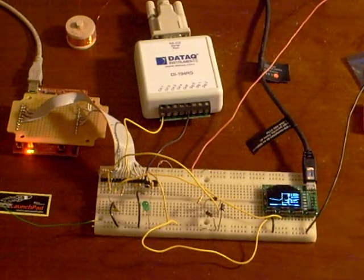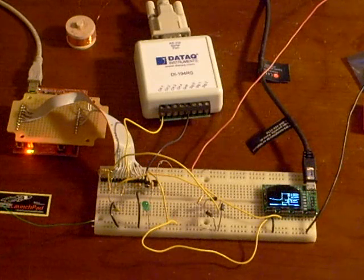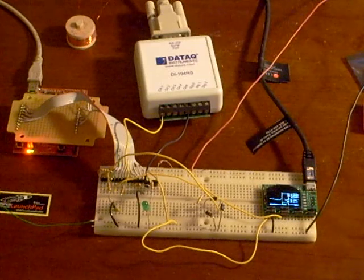For show, I've added an LED that flashes every time the coil is activated by the microcontroller. The unique feature of this particular control system is that it is regulating the pendulum — by comparing how fast the pendulum is moving with the crystal reference of the microcontroller, then adjusting the pulse width fed to the pendulum to speed it up or slow it down and keep accurate time.